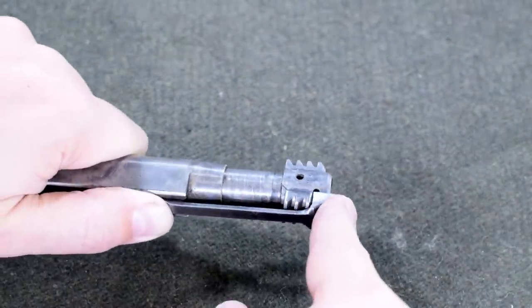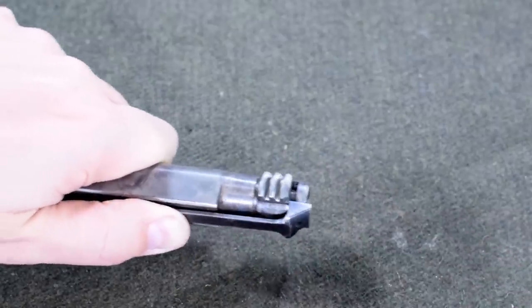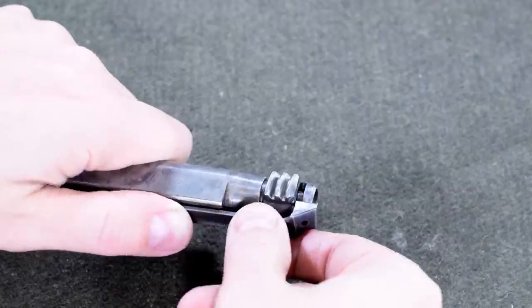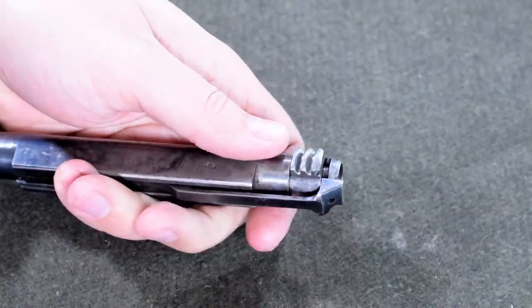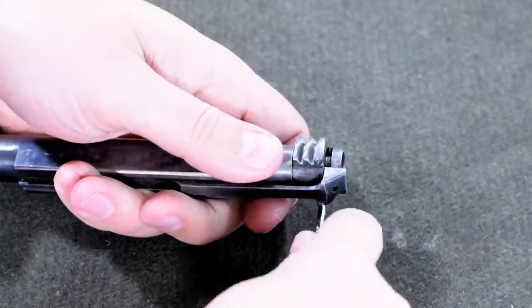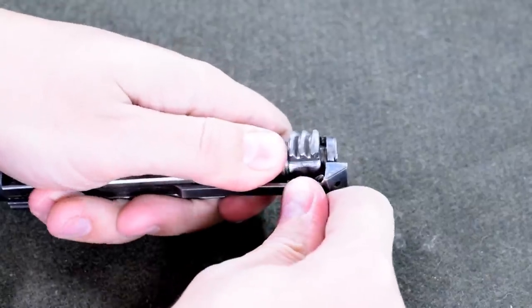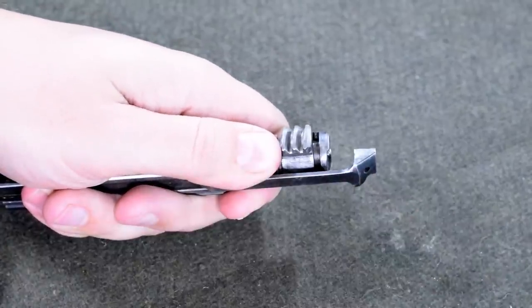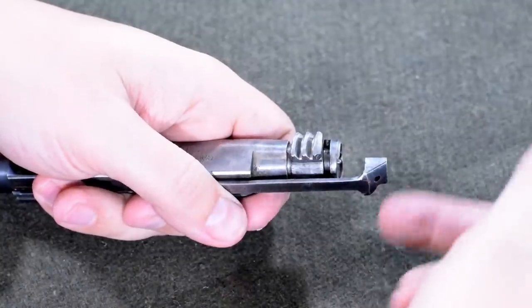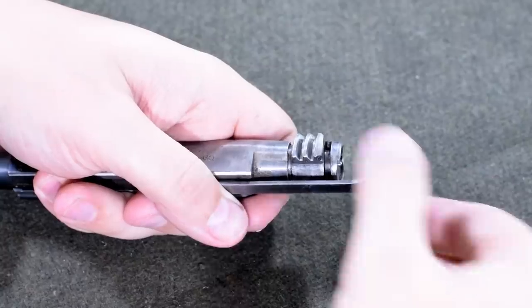The way the gun's supposed to work is: this is unlocked, and then as we push in and this is released, it goes into that locked position. Now, this is also where we can disassemble the bolt. I don't even need to do a full disassembly to show you what can go wrong on reassembly. The way this would come apart is we hook the extractor and pull it out the front. Then we can remove this piece. I can actually just pull this bolt head out and give it less than a quarter turn and put it back in in the wrong slotting.